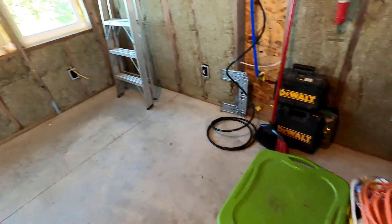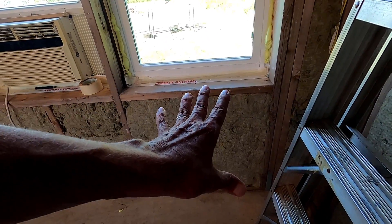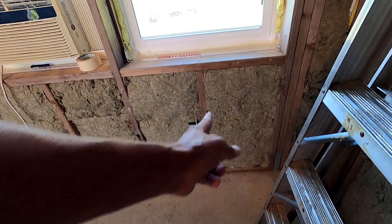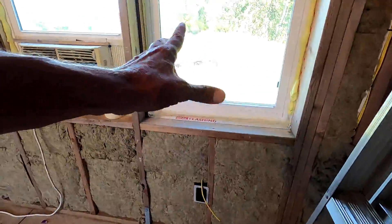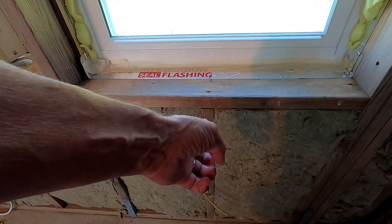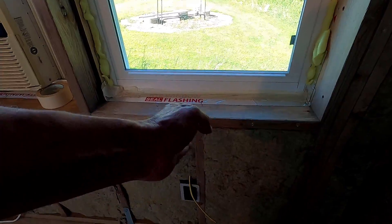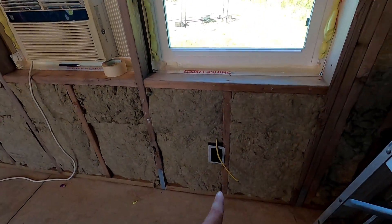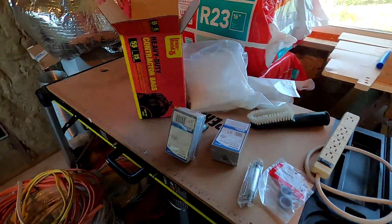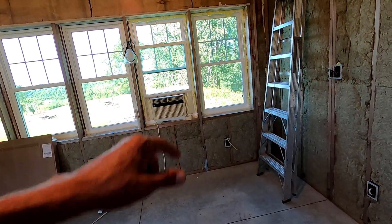So what I've got to do is pull this piece of insulation out and then run a wire from this box over, drill through, and then on the outside there are furring strips right where each one of these studs are. I have to add on to the side of the furring strip, which is semi-difficult, and then drill a hole through that and get my box and tube and stuff in there. I'm going to start out in here and then I'll be working out there as well.